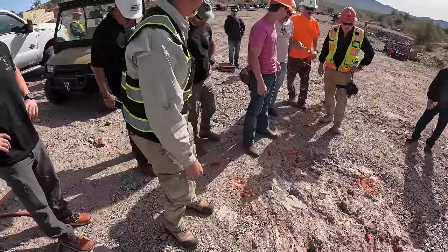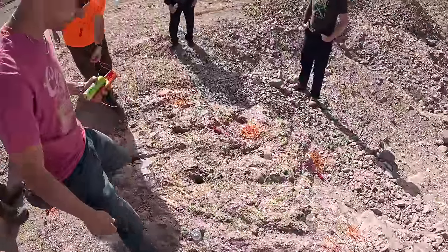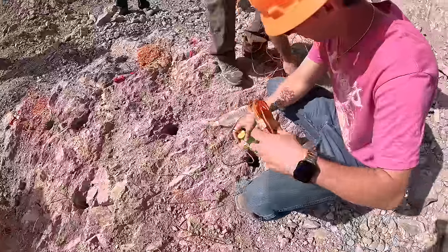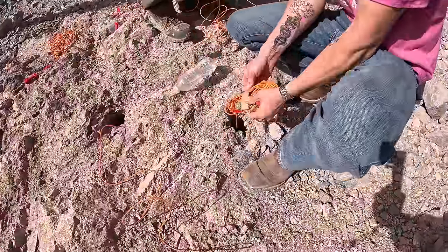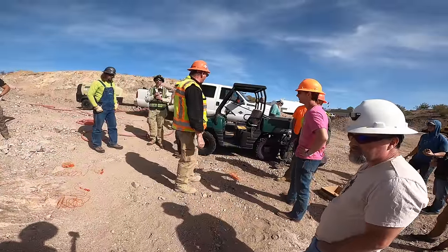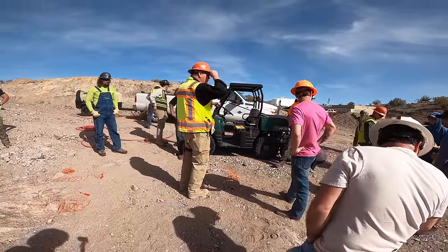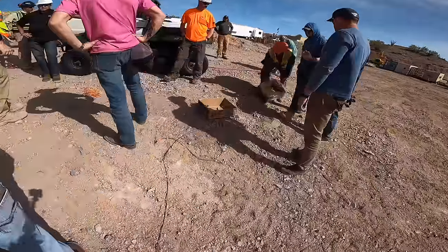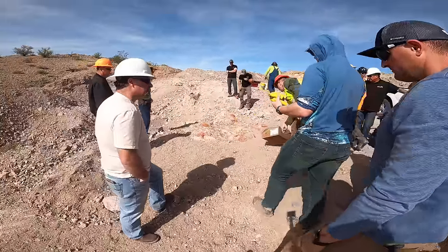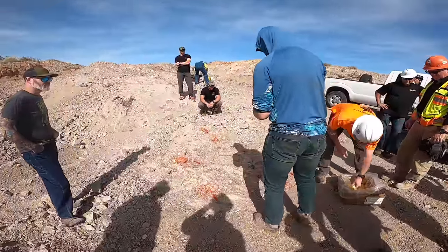Last time we did a stick and a half, and it was perfect. Thank you, sir. So we're going to try that again. We've got some half sticks over here. We got 8 holes, so we cut 4 sticks in half, and then we're going to need 8 full sticks. We'll drop those down and we'll measure and see where we're at. Make sure we got enough room for stemming on top. Tie it in and shoot it.